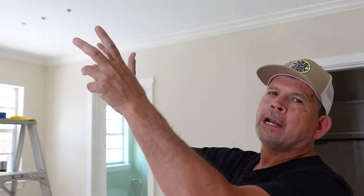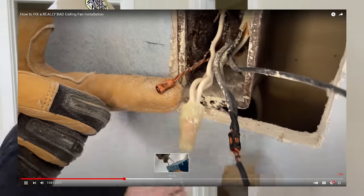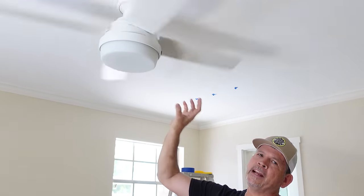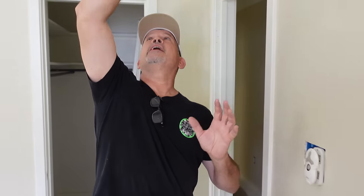If you're doing a bigger remodel like we are, have your electricians do the same thing — it's going to save you a big headache. For most people watching, you're going to have a single gang box with just one switch controlling a fan or light in the middle of the room. This bedroom actually had a single gang box when we started, but we upgraded it to a two gang box so we could have two switches or more. We show you how to convert a single gang box to a two gang box with no drywall patches. We also installed a new fan-rated box, ran a cable from the new box across the ceiling down through the top plates into our new two gang box. If your electrician can't do it, you can run those switch legs yourself — we'll put a link below in the description.